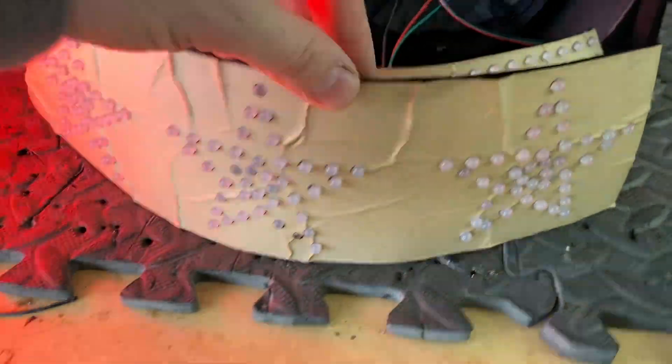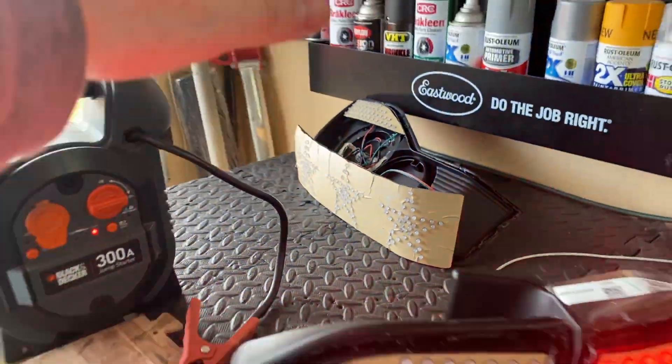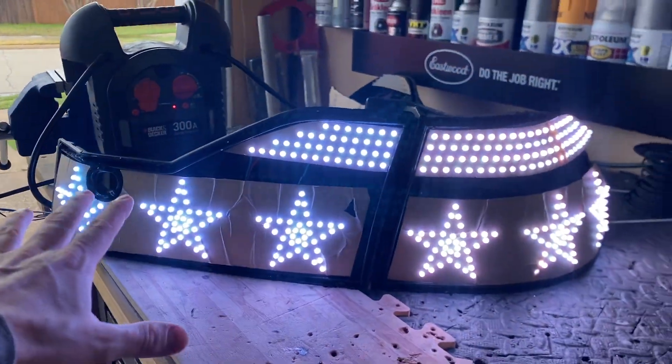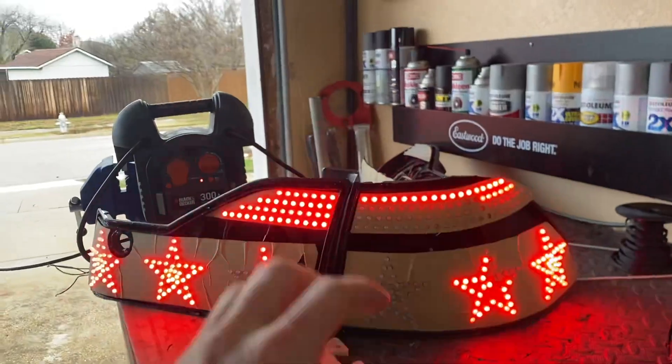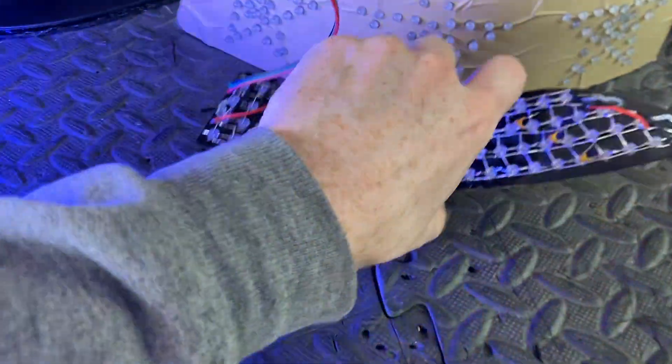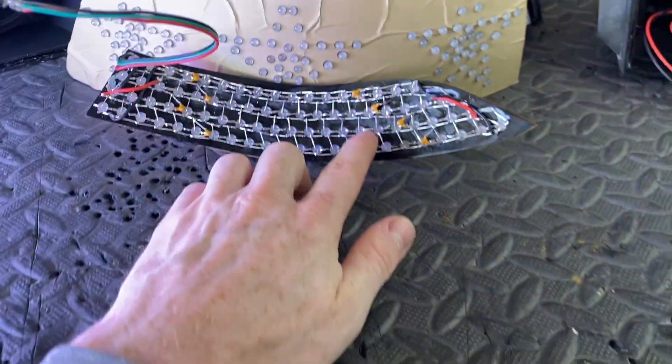We ran out of through-hole LEDs and had to wait a couple of weeks for them to come in. Once they arrived I got everything installed and started wiring everything up, trying to get one side done to understand what I needed to do on the other side. While wiring, we had issues with flickering — especially when it was all white — where it would either flicker a lot of LEDs or shut the Blue Ghost module down. Stop Motion Lighting and Simply Adjustable were DMing me with things I was doing wrong, and one critical thing I didn't realize was that I absolutely had to add capacitors.